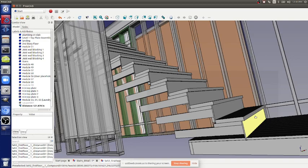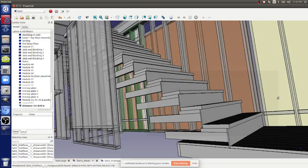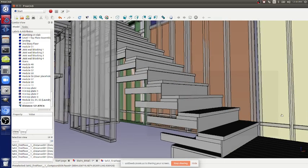Yeah, I mean, the best approach would be... Man, stairs are hard. Well, we're going to assume we got a 2x8 platform. We're going to measure the distance to the top. But remember to add a quarter because of the finished floor. And then divide by 14.